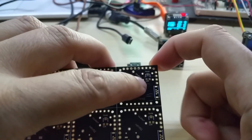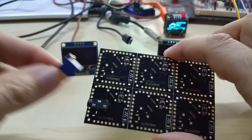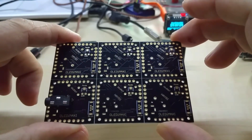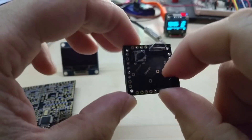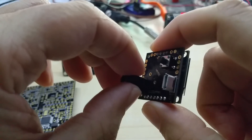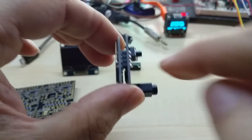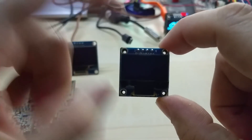For the voltmeter, I also have a trimmer that I will put on here. These parts will go on my CNC controller that I'm just making two of. The Maxi PCB has everything on there in SMD, and it's really nice and small. If you don't want the jack, you can just attach wires to it and extend the button, or use one of the many 5V and ground connectors for a direct wire connection. The displays are soldered to the PCB so you can use M2 screws to mount it from the front to your enclosure.